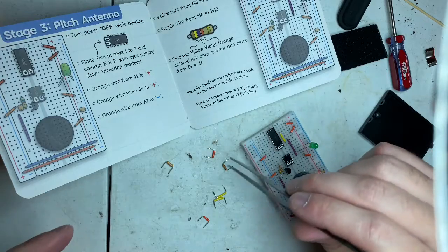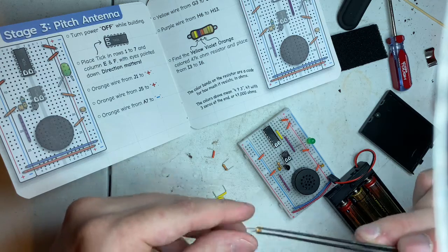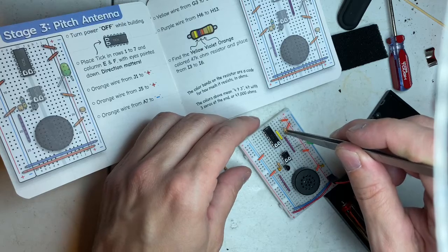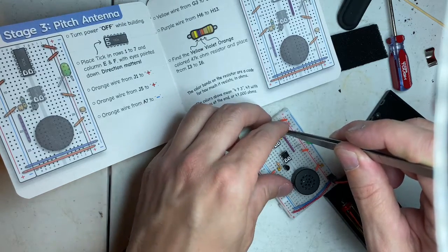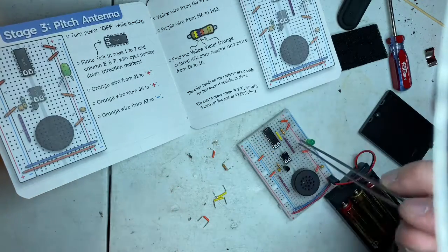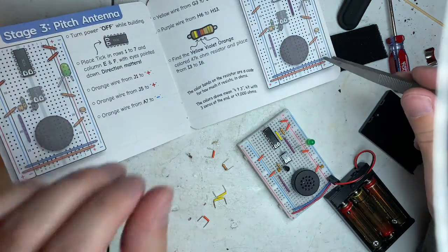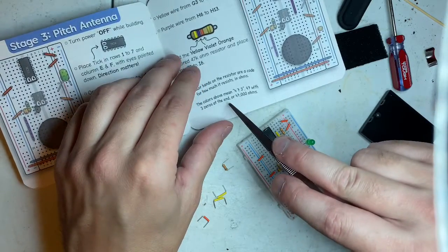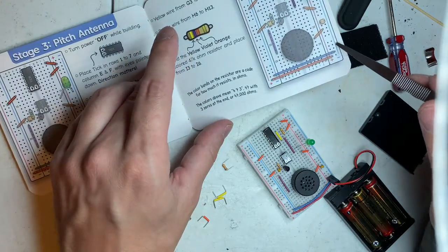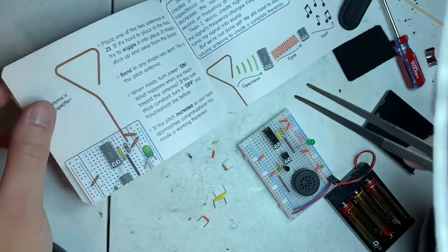Again, find the yellow, violet, orange. So yellow, purple, orange, from I3 to I6. Here's I6, I3. Color bands are the code for how much they resist in ohms. That's right. Colors above mean 473. 47 with 3 zeros at the end means 47,000 ohms. There are the color code things. So if you get into electronics, that's what you need to look into.